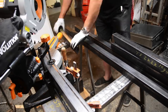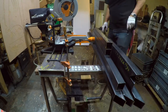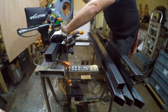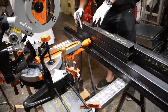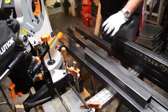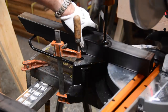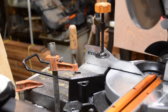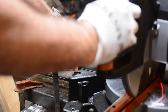I know the size I want — I'm making a bench that's about 53 inches wide by 20 inches deep on the seat, and the height of the back is about 22 inches. I'm going through all the cuts making sure everything matches because I want a nice square look — that's basically the style of this bench. That little six or seven degree chamfer is going to create the tilt on the back.